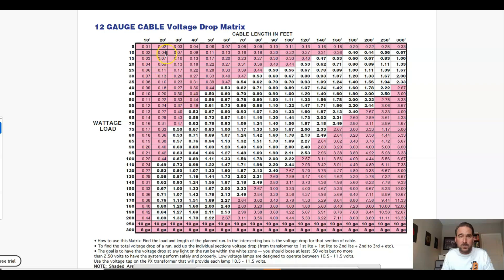And it's going to be very rare that you hit that, because in many cases half your lights are going to a front yard and half to the back, so you might have separate lines covering each half. Take a screenshot of this chart or get it from our website on the how-to videos page. Just because numbers appear in red doesn't mean it's bad — this chart was designed for halogen lights where you had to be within about one volt of 11 to 12 volts. With LEDs you don't have to worry about that. If you have a bigger line, use your 15-volt tap because that gives you a lot more leeway. At 300 feet we're only losing 3 volts, so we're well within range.